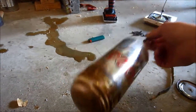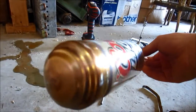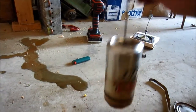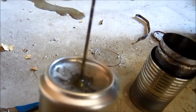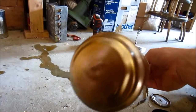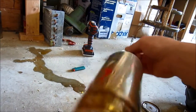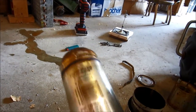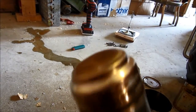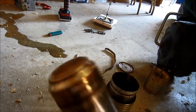That is a problem — look at that, the bottom of the can popped out. So it got a lot of pressure inside there, enough to pop that bottom out. Wow. So that's why — look at the rod there — the JB Weld didn't hold up to the high temperature, and that bottom busted out from the pressure. I wonder how I would make it so that this doesn't build up so much pressure in there. That's why it was hitting the bottom, because that bottom bulged out.